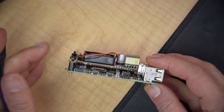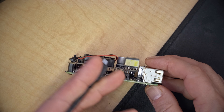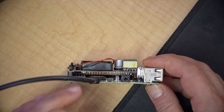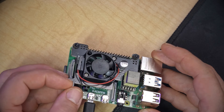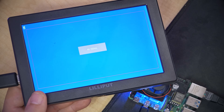Next, we're going to get ourselves a display. I'm using this little display for the sake of making this video, but you can use any television or computer monitor that has an HDMI input. And we're going to connect it to the HDMI output on the Raspberry Pi. I thought those were USB micros as well — they're not. They are micro HDMI, and you will need a micro HDMI to HDMI cable or an adapter. The instructions say you need to use the one that is closest to the USB port — they are not interchangeable.